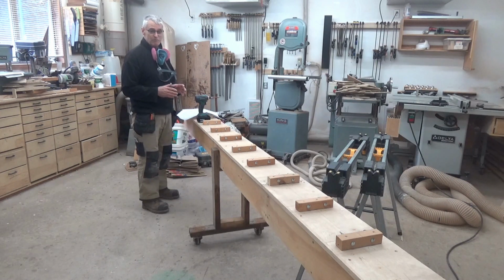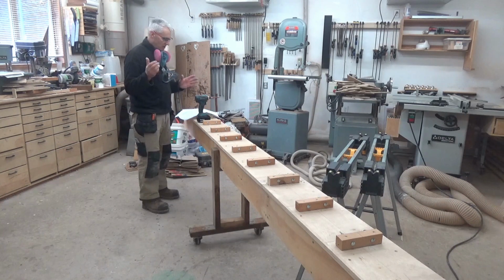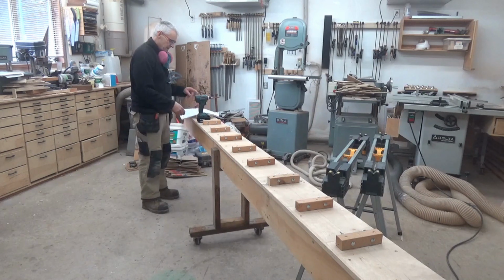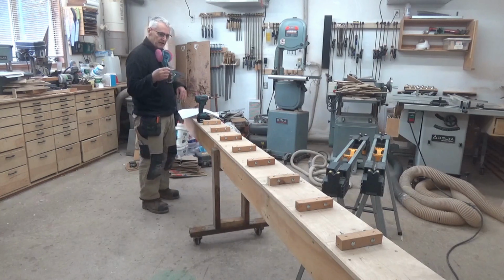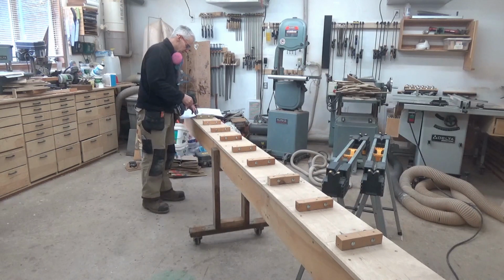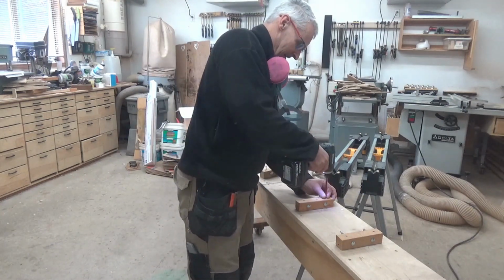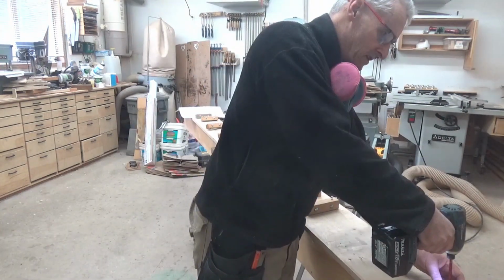It's 16.1, but there are 12 forms in here, and if I accumulate that 0.1 over 16 inches, it'll come out a bit longer. So I need to take my blocking off that I have used for many boats and respace it out to 41 centimeters. You know, I just like to be able to put it back together and put it away for the next one.